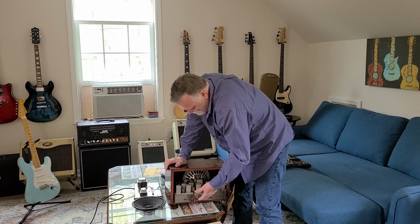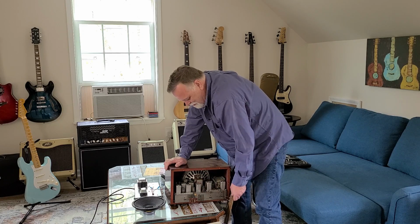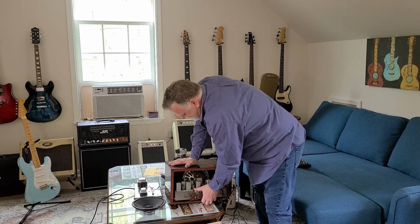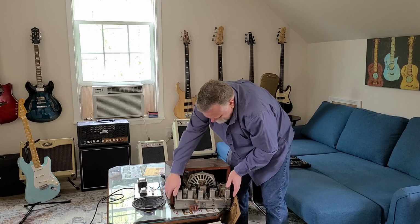So I thought I got this old amp. I said, well, if I can fix this, I can use this as a guitar amp. But really, this is a hot chassis amp. So depending on how you plug it in one way, this is ground. You plug it in the other way, this is hot. And these old radios are made to work that way. And that's why they're, this cover, and they're not user serviceable supposedly. Anyway, it's just something I'm never going to use, so why not repurpose it?